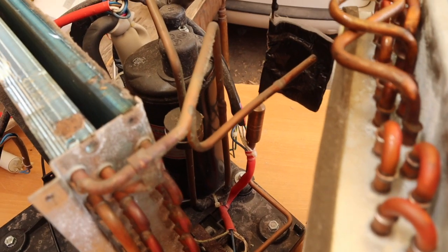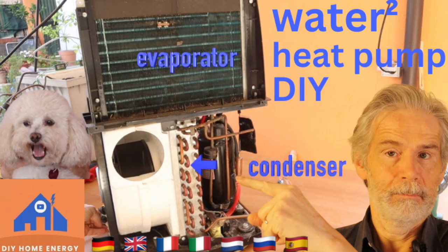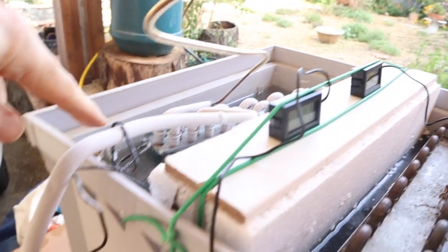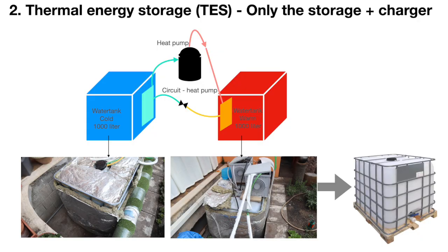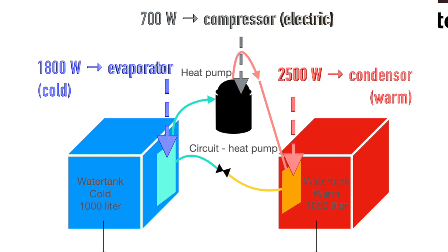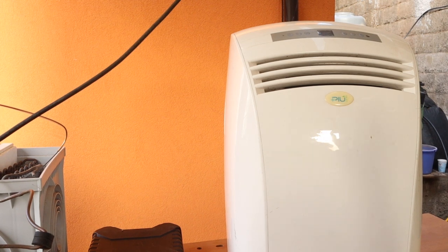Let's break down how this works. The core is a low-cost, low-power heat pump — or even more than one, which can work in parallel if your PV is working like crazy. Last week I transformed a small air coil into a heat pump that works with water instead of air. What's special here is that we use both the heat and cold it generates, doubling the efficiency. By connecting both cold and hot sides of the heat pump to large water tanks, you can later use this energy exactly when you need it. For the do-it-yourselfers, you can repurpose an old mobile air conditioner, making this project not just efficient but also affordable. Water-to-water heat pumps are mostly expensive, so DIY can be a solution here.